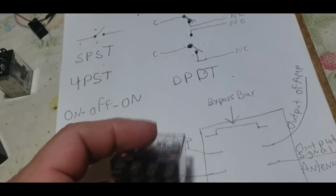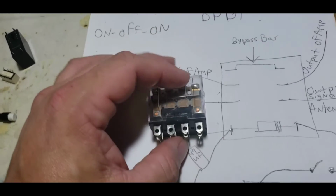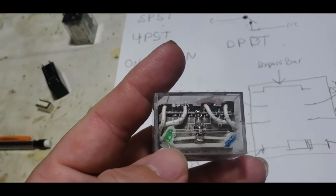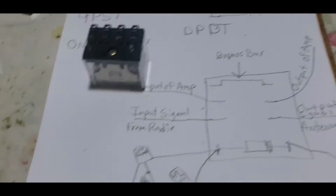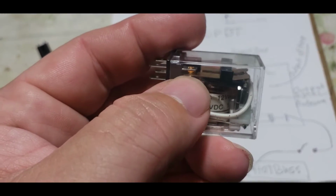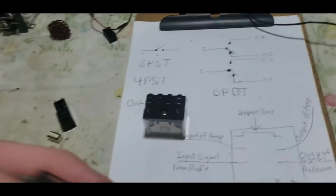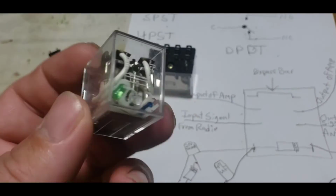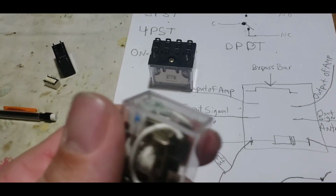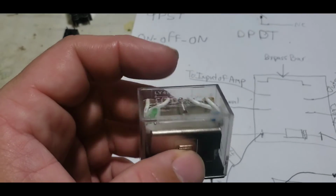Before we go to that, take a look at this big whomper. I've got quite a few of these, and I have not used one of them yet. By the way, everybody, if you ever get these relays with the LEDs in the back of them, be very, very, very careful. I've had a lot of bad luck with these relays. I no longer use them. Had a lot of issues with the armature right here that's on the actual common breaking off from the lead right here and moving. So when you key up, you lose receive, and you got to key up again to get receive again. I've tried to see if I could fix that myself somehow, and I haven't had any luck. And what sucks is I bought, I think, 50 of these relays because they were so cheap. And I used about 10 to 15 of them before I figured out what was going on. And that's why I haven't used these yet.